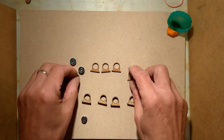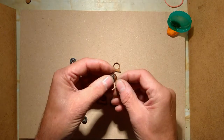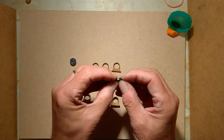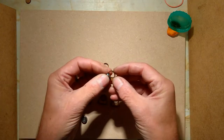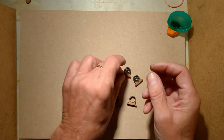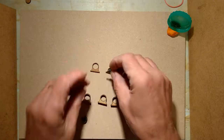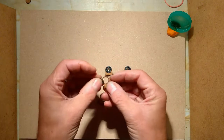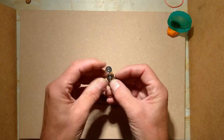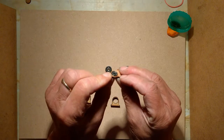So we start off by putting a bearing on the thin one into the clean side, push it through. Do that on the other 4. Again, bearing in on the clean side, clean side, and clean side. And the bearing protrudes slightly out the other side.